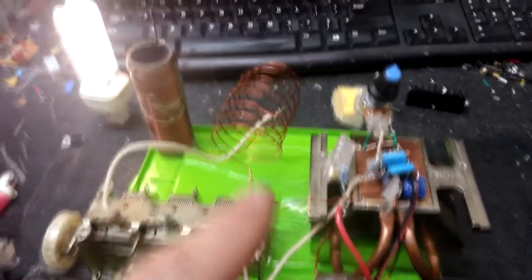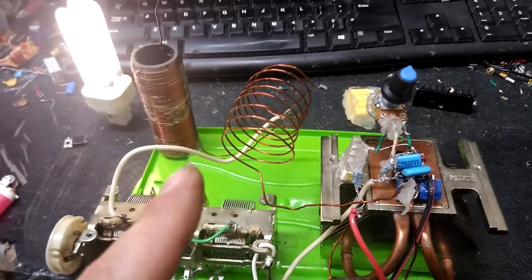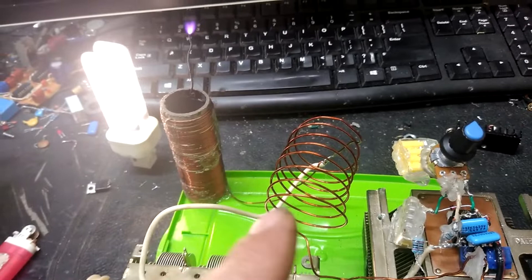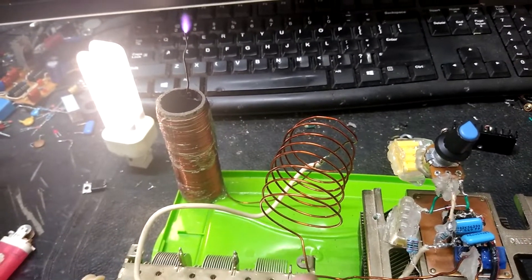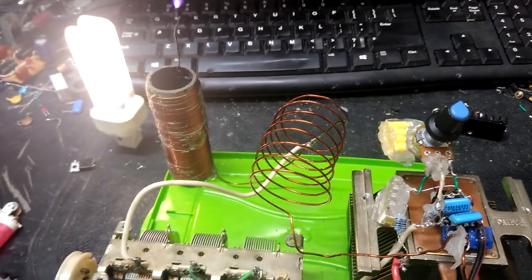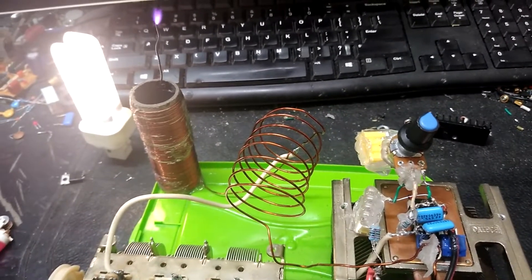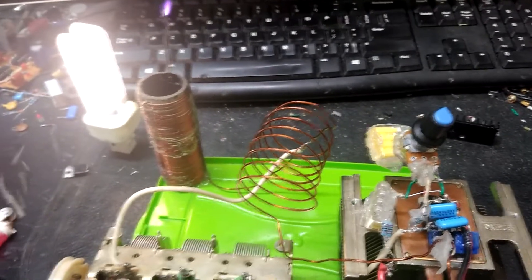This wasn't really the best setup — I just tossed some stuff together. I burned out way too many FETs: probably 6 IRFP250s and maybe 2 or 3 460s. That's way too many MOSFETs to be burning out. I was just anxious to keep messing with it, but clearly this circuit needs rearranging to avoid that.